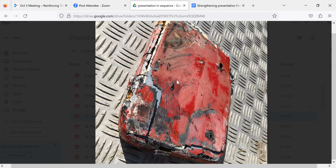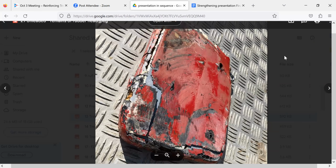I'll wrap some carbon around it. Carbon fracture, carbon pull apart, or did it delaminate? It delaminated. It's got two things that go into the gudgeons. And then this one just let go. It was just bare strands of carbon. When you added the carbon to fix the cracks, did you sand it down to glass or carbon? Yeah, it had to. A big chunk. And then I put some bearing compound in it and just wrapped it.